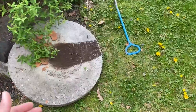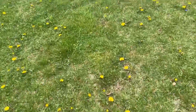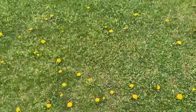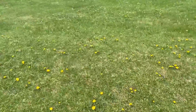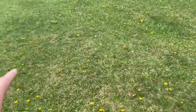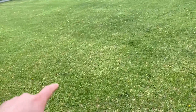As water goes from the tank, an equal amount goes into the pump chamber. On this property they pump it up to what we refer to as a distribution box — about 18 by 12 inches, placed about four feet below the surface at the top of the hill. If you're looking for the trench lines, sometimes you can see little divots in the grass just like this, showing you where somebody's trenched the ground.